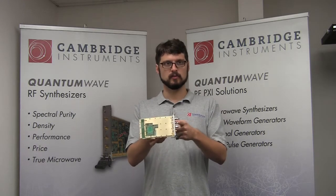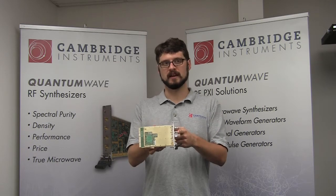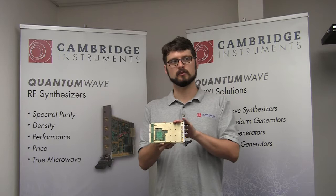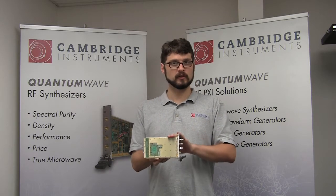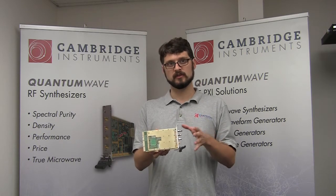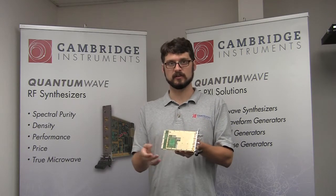The middle channel provides a user-specified microwave band with fixed output power. This card contains the band from 7.2 to 7.8 GHz, suitable for calcium and ytterbium ions. Other bands available range from 7 to 13 GHz depending on user specifications.